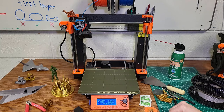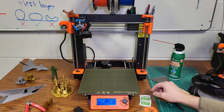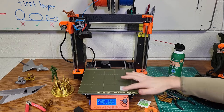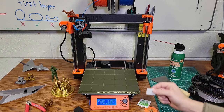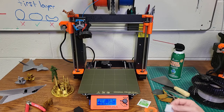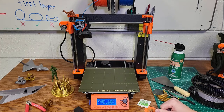I've got my new PLA filament loaded up. Now I want to make sure the bed is clean and ready for printing — I already scraped off all the old plastic. Sometimes people touch the bed with their fingerprints, which you should try not to do — only touch the edges of the sheet. But sometimes fingerprint oil gets on there, so it's good to clean the bed with an alcohol pad. These are pre-moistened with isopropyl alcohol, so I can just wipe the bed to get rid of those fingerprint oils. Don't do this too often — it actually wears down the plastic coating on the steel sheet. Only do it if prints aren't sticking and you've tried everything else. Now the bed is cleaned, there's no plastic underneath that could get caught in the belts, and everything is clear — I'm ready to start my print job.